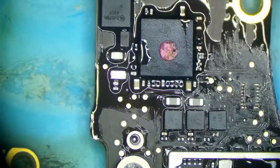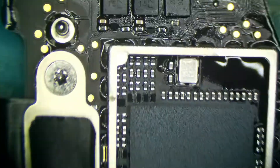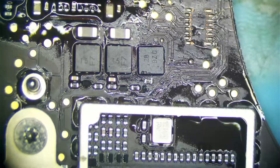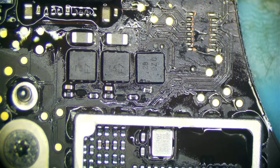Double checking — no solder blobs popping out the sides. That looks connected, but I'll touch it up with the iron. There's one more right here that we'll use the iron on because one of the pads is broken. Let me double check that this is a 10K ohm — and it is. I need to find another one of these resistors, and we should be able to take one from right over here.